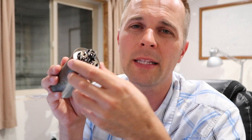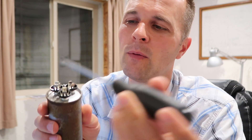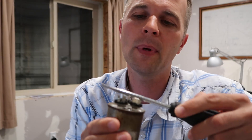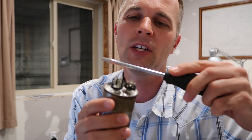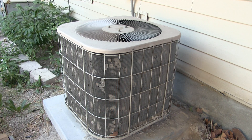Remember, this is 240 volts — it can kill you easily or really mess you up. Before you start pulling the connectors off, you're going to want to discharge the capacitor. What you do is take a screwdriver and cross common to Herm and common to Fan, shorting those terminals. Make sure you're holding the screwdriver where you're not touching metal, otherwise you're going to get zapped. These capacitors can hold a charge for years, even if the air conditioner hasn't been on for a long time.